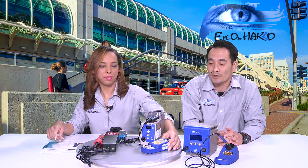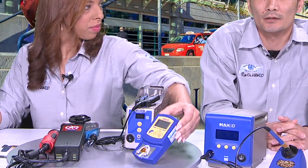An accessory compatible with the concept station is the FG100B, our tip thermometer released in 2019. When used together with the FN-1010 soldering station, the station can automatically calibrate your tips. So those are the two stations we'll have over at the soldering section.